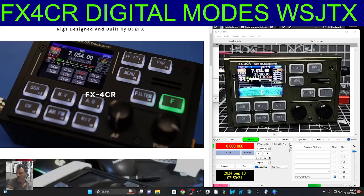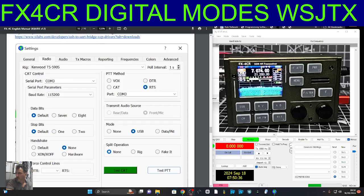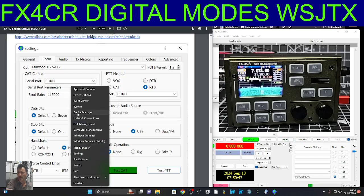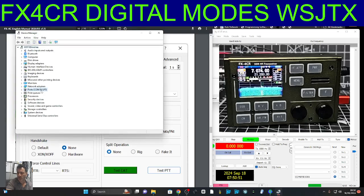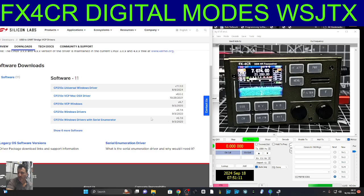Today's about the FT8 settings. On the left here we've got the settings described in detail, so you can see there you select your COM port. Mine is connected — if I right-click Device Manager and double-click Ports, there it is. I have been trying to install the Silicon Labs driver, so this might be my problem. There's a link for the Silicon driver just here and I'll put it in the description — CP210.